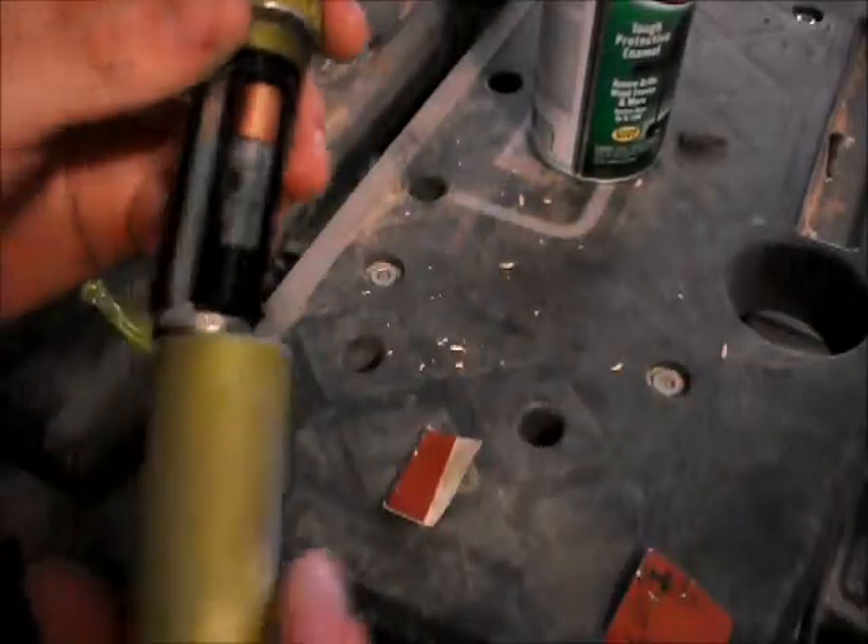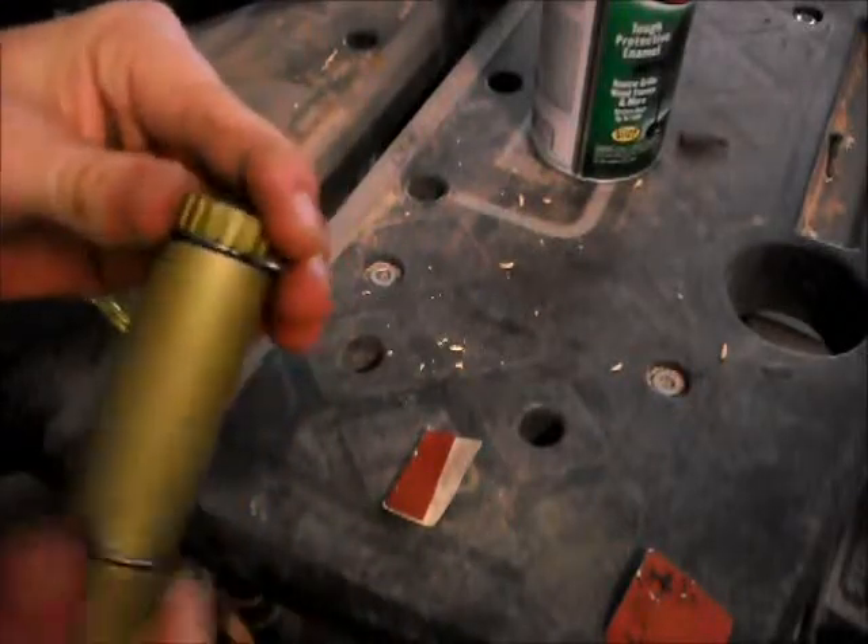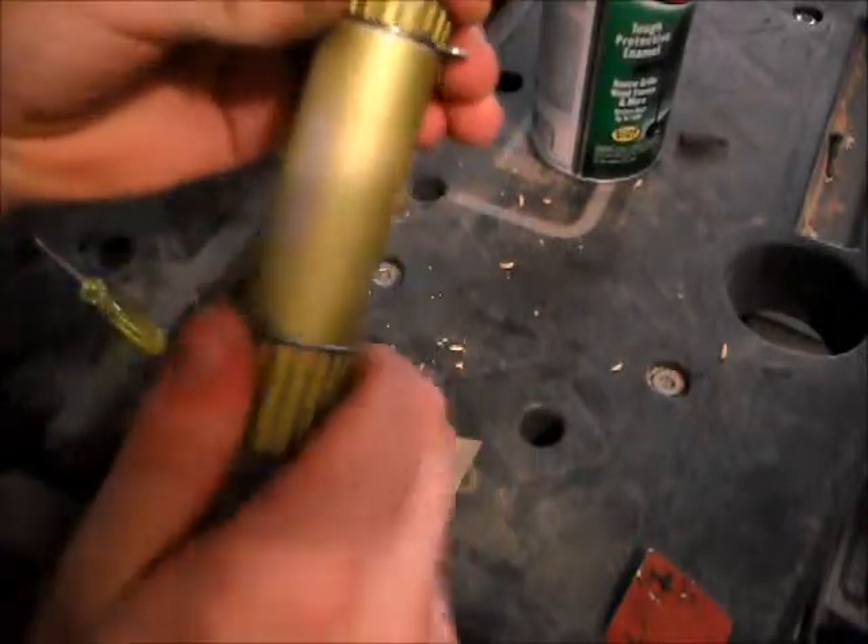This is pretty much done and prepped. I'm going to take it outside and paint it up. The last thing we're going to be doing is the painting, using the high heat right here. Shake it up — the reason you shake it is because a lot of the paint particles will come out sloppy in blotches, and you want it to come out thin so it has an even cover. Just thirty seconds or so.